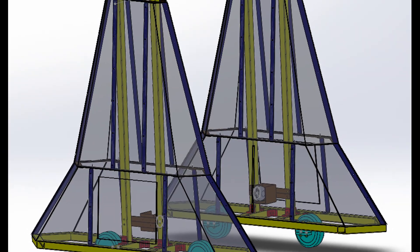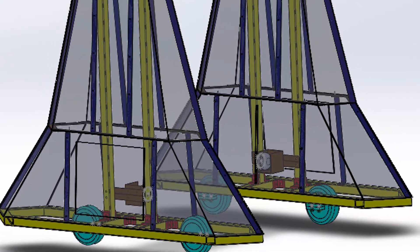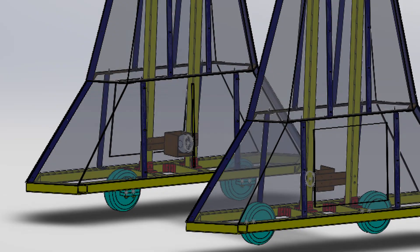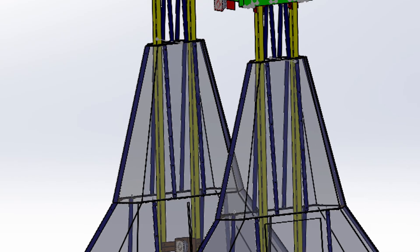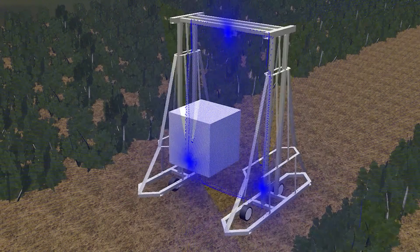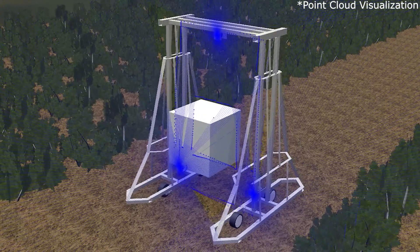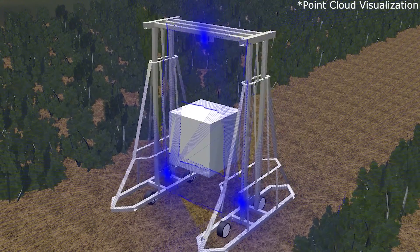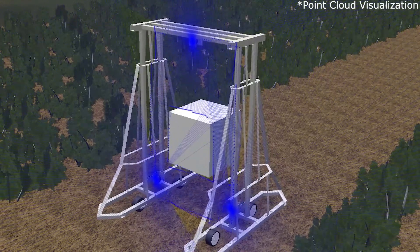The large base pillars allow the robot to separate overgrown crops from below as it moves down the row. The robot has three lidars — two mounted at the bottom and one mounted on top — to maximize the robot's view of the plant. In addition, there are two velocity-controlled hoverboard motors that allow us to gather positional readings, and the frame is constructed from aluminum to minimize weight and rust from the outdoor environment. In operation, the robot is controlled by a Raspberry Pi, a single board computer that controls and collects point cloud data from the lidar units, and an O-Drive motor controller. The O-Drive is able to control two hoverboard motors at a time, and our design is scalable to accommodate a second O-Drive and two additional motors to implement four-wheel drive.